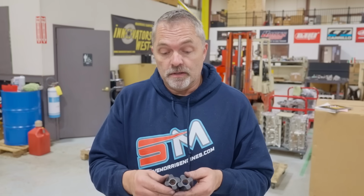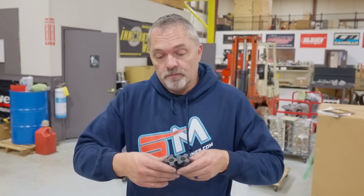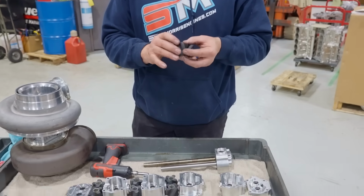The cylinder bore, which is always coated in oil, if it didn't have oil on it, it would just immediately gall the piston skirts, right? So it has oil on it, and that friction in between the oil film and the barrier still wears away that coating. Also, it has a little bit of squish. So if this thing was super tight, it would just wear itself away. And I think us doing this initial dry, this one's different because it is dry, will probably do something there. As far as wet sumps, there were some comments below on the other video that some guys were doing this on their Coyote pumps, and it really helped out a lot with pressure, noise, and wear and tear.